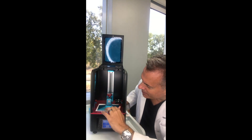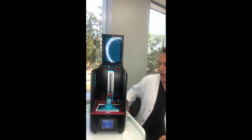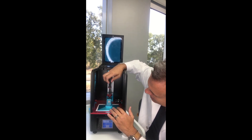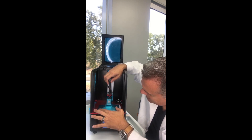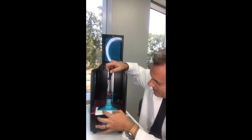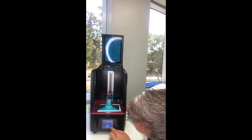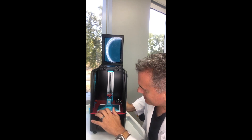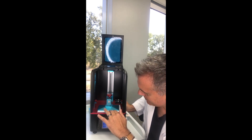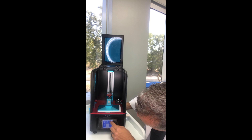We went ahead and put this down. You can see my paper is held on in the corner but it's not down all the way. So what I want to do is go ahead and loosen up the bolt — the Anycubic Photon actually just has one bolt. We're going to let that go, make it kind of loose, hold it down, and then tighten it. On the screen there are different increments the plate can move, so we'll hit this a couple of times to get the plate down enough so that my paper is snug.